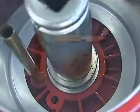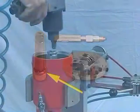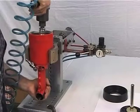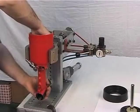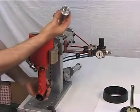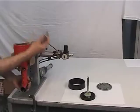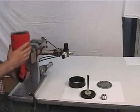Keep the oil dynamic cylinder, figure 24, pressed upwards. Unscrew and remove the guide stem connector, figure 74, using a special wrench supplied on request. Now the oil dynamic cylinder is free from the tool body, figure 72.